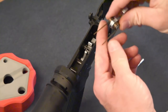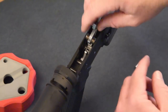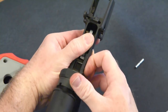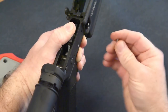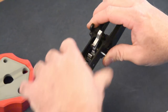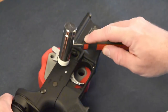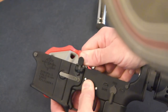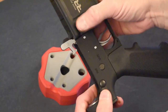Install the hammer. The legs are actually going to go backwards and they're both going to sit across the trigger pin. Install it in that orientation, and then you're going to have to put some pressure and twist the hammer to line up the pin hole so that you can insert the pin. Give it a little twist around — sometimes you have to do a little twisting and alignment mid-stream just to get it going. Always use the nylon end of your hammer, and we're flush.